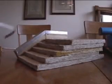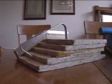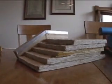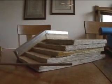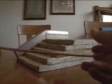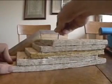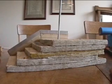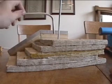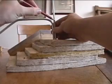Okay, so like I said, I'll be building just a regular handrail. No kinks or anything like that, just out of round rail. So I just found an extra scrap that I had, and I think it's almost the right size. Don't worry about measuring yet, just bring your whole piece in. So first you need to decide how high you want it off the ground. You don't want it too high because then you won't be able to get on it, or too low because then it'll be bad. This is about how high I have mine, which is maybe 2 inches, 2.5.